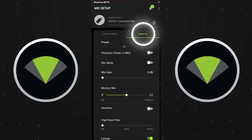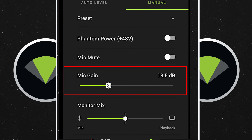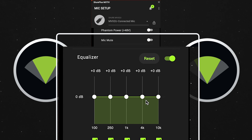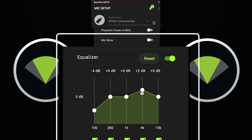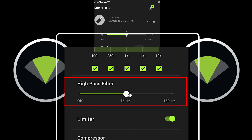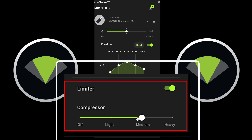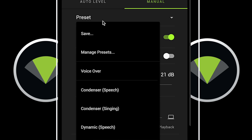Going into Manual Mode, which is what I prefer — Manual Mode gives you more control over all the details. I can set the mic gain appropriately, turn on an equalizer, bump the 4K, drop the 1K, drop the 100, and so on and have more control over the EQ. I also have a high pass filter, which I definitely use for vocals. You can set a limiter on and turn the compressor up from light, medium, or heavy. Monitor mix means what comes out of the headphone monitor — do you want to hear the mic or the playback, dry or with everything going on? That's a nice option to have, and of course you can save the preset so you can come back to it later.